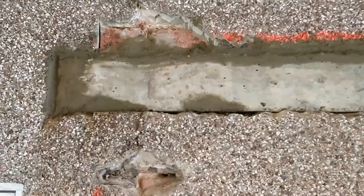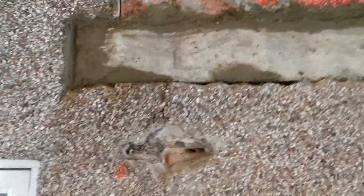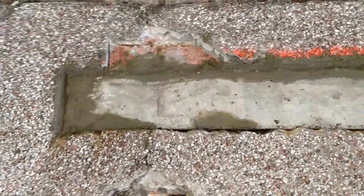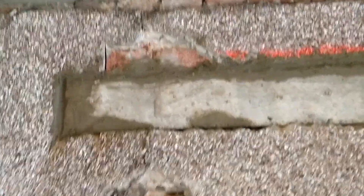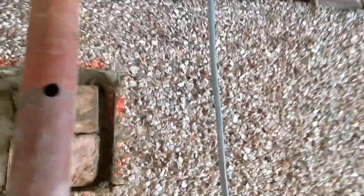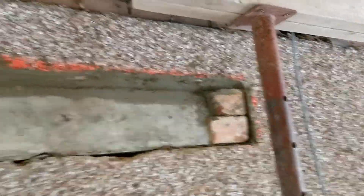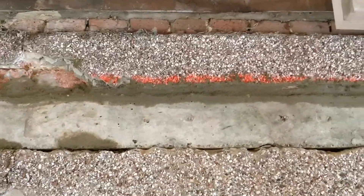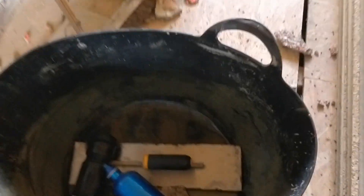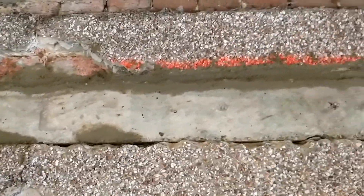So that is now in, which is really good. It's going to have 200mm of bearing — twice what was specified by the structural engineer — before I take this wall out, pretty much on that crack. On this side there's plenty, and I've put two bricks back in here and packed them in, so that's fully packed on this side. I need to do the same on the other side but I'm out of cement mortar here, so I need to take all my stuff down and go to the other side of the house and do it there.